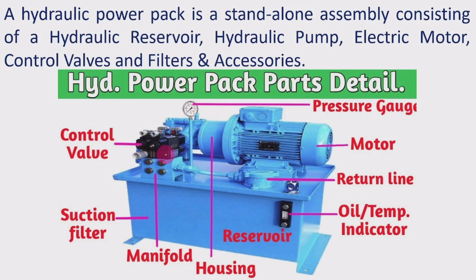The control valves may be a direction control valve, pressure control valve, or flow control valve. After that, the flow line is supplied to a hydraulic actuator that produces output work — either linear or rotary. Accessories such as a suction filter, oil temperature indicator, line connections, and pressure gauges are used along with the main components. There are 5 main components and various accessories in the Hydraulic Power Pack.